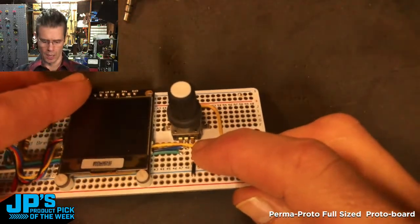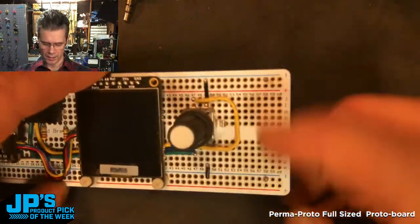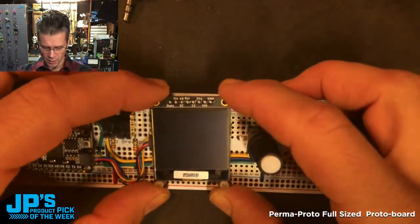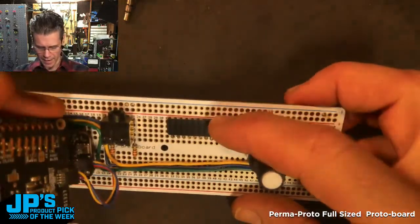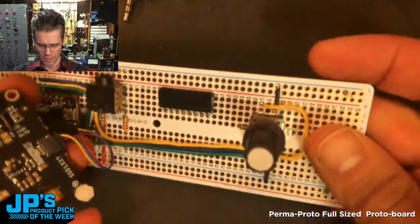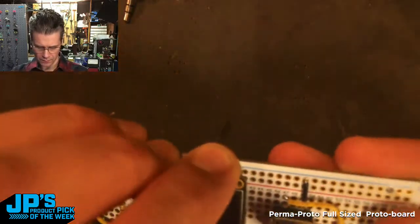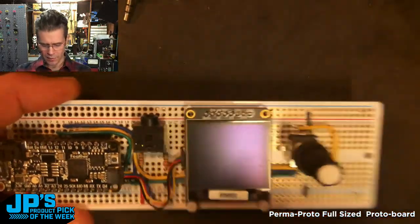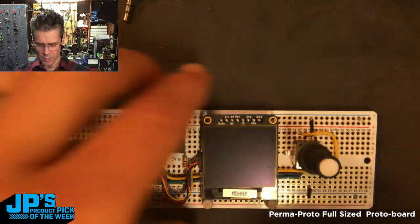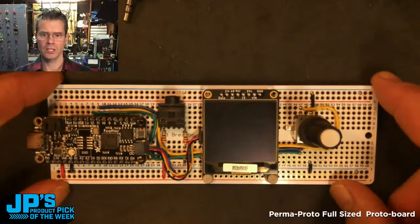So there's 3 encoder direction pins here, and there's the 2 button press pins, and those are not touching, not related, not connected there. And then in the case of this little screen here, I just mounted a right angle header that's not soldered to anything. It's just soldered to the board. It's not a connection I'm making. And a little right angle male header there, so I can slide that in and just get that stuck to the board. But rather than go through all of the wiring there, I didn't need to. I'm just reusing this little I2C connection, which means I can also pick up some I2C on the other side of that screen there, which is kind of cool and convenient.